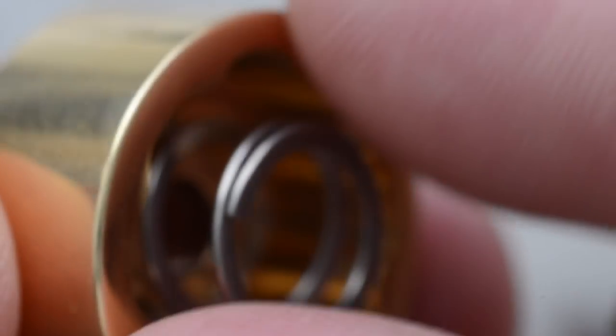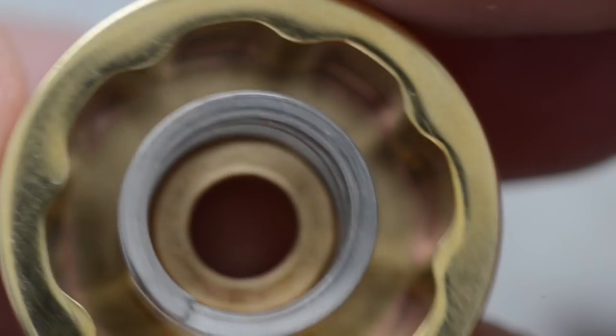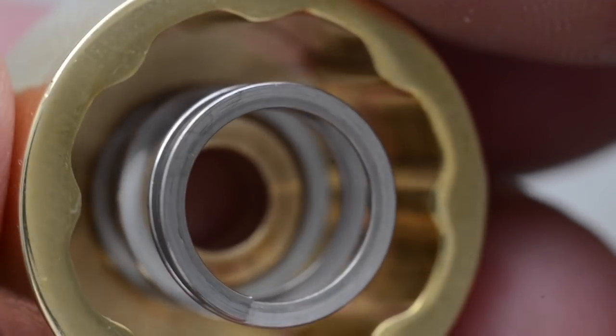Disassembly reveals a flat spring. I might actually just remove this spring and install my own — I'll probably make a coil spring out of 16 gauge wire and stick it in there, or maybe just use two magnets to stiffen up the throw.